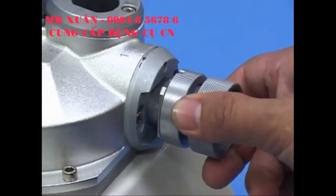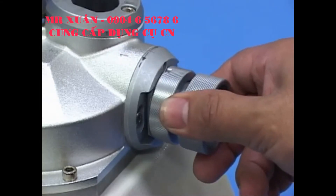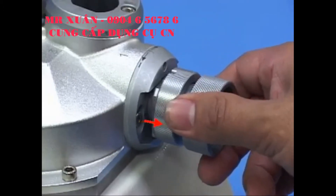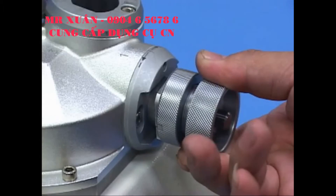Point the ER holder at the notch of edge resharpening port 1. Insert the holder into port 1 with a slightly push motion for grinding. Take out the holder with the end mill and rotate it clockwise to change to another flute.